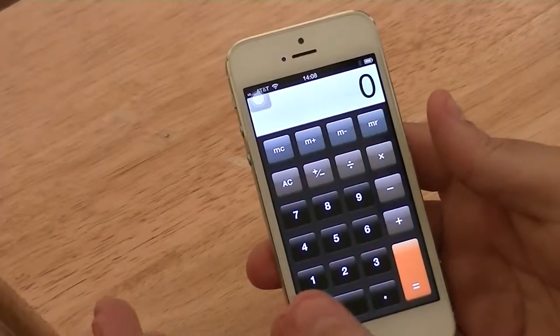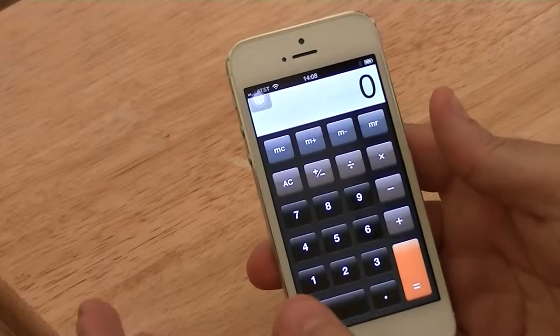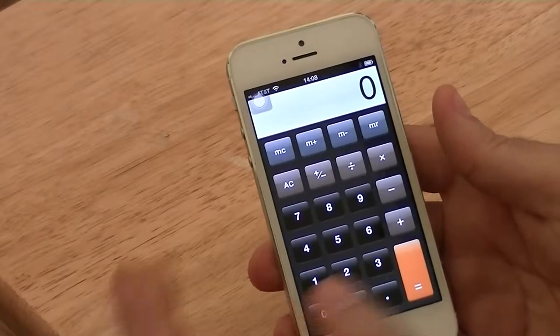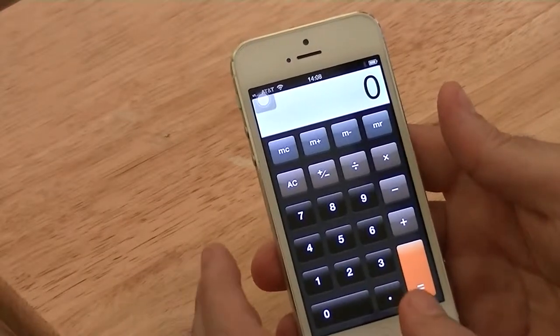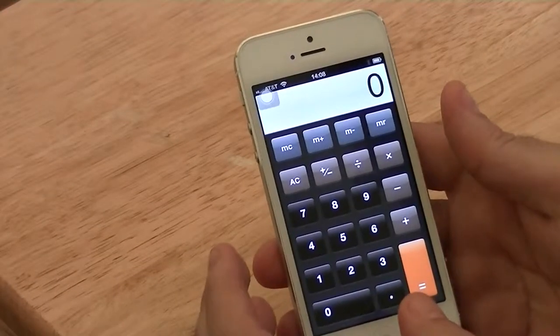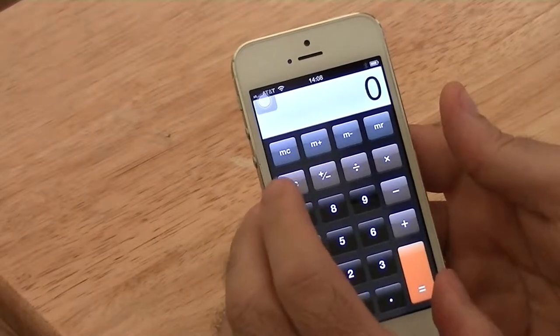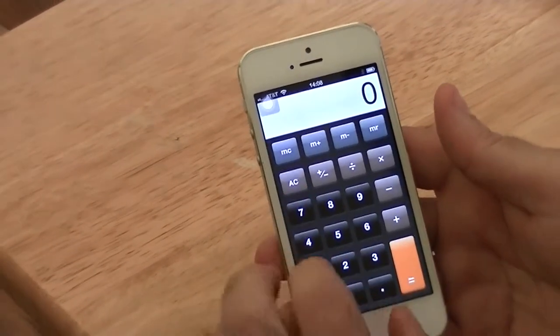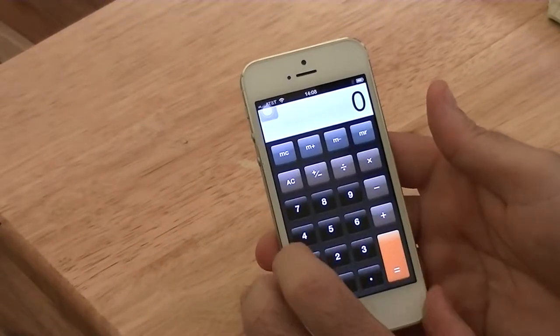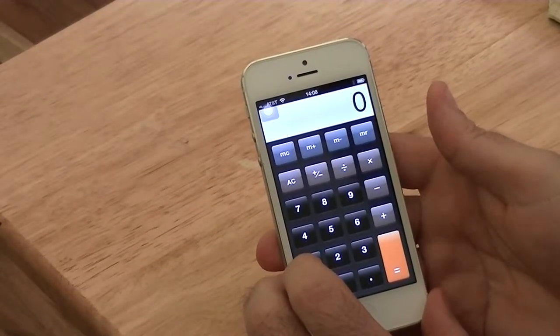One important thing: never try to do math calculations while you're up in an attic. Record the data that you need to capture and do the math in a more comfortable environment. You're guaranteed to make mistakes if you do it when you're above an 80 degree dew point. There's just something about that that's wrong. So I captured those eight different data points of the feet per minute.